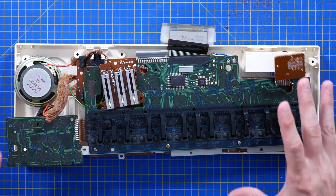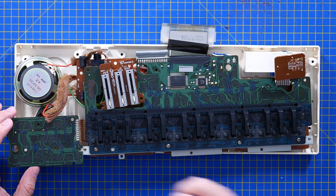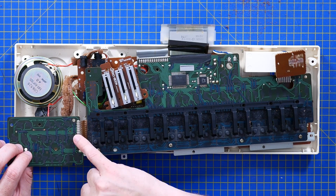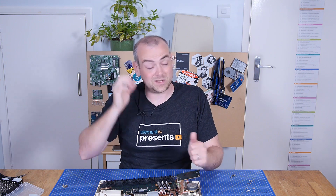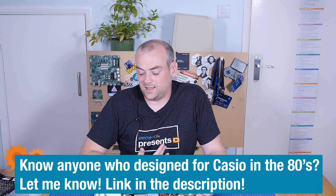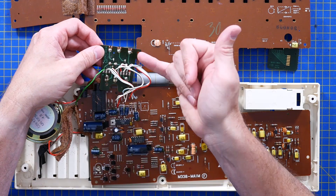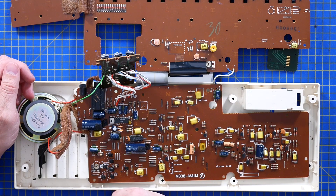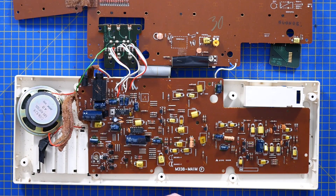It's interesting to see where they've used individual boards. I'm surprised they didn't try and rationalise these through case design, making those little plastic buttons a little bit longer so they could go onto a board the same depth, rather than having them separate. It feels like it would have been a cost saving — saving the ribbon and the soldering — but maybe injection moulding was more complicated and maybe plastic was just a bit more expensive back then. This separation between digital and analogue — I guess it's all down to what side they wanted the PCB on, being a single-sided board. It just seems strange that you'd cut a hole out of one PCB just to fit another PCB in the gap. Double-sided PCBs were technically possible back then, so why not use them? Was the cost that prohibitive?